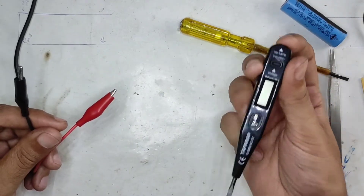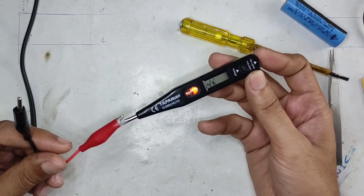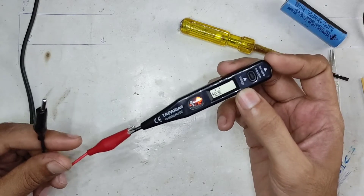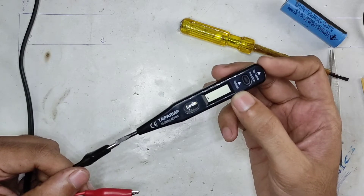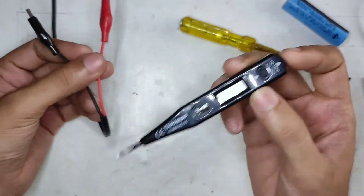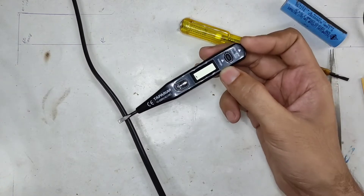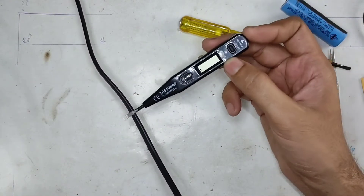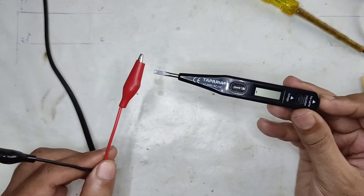Now the neon bulb — if I touch the neon bulb point, you can see it lighting up brightly, and it will show some random voltage on the screen from picking up extra noise. You can see the flash mark on the screen. That's the way this works — you just hold it and move it across the wire to know whether there's electricity. If the flash mark disappears after some point, that means the wire has a break after that.